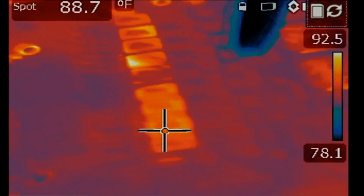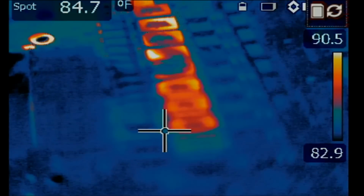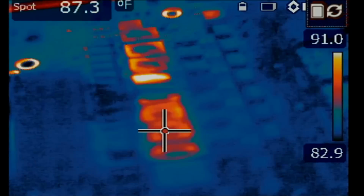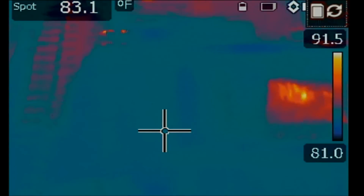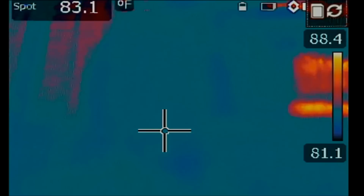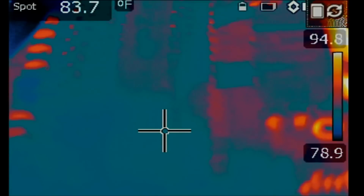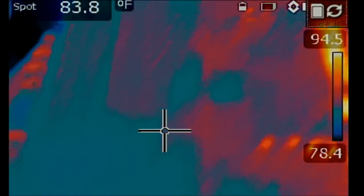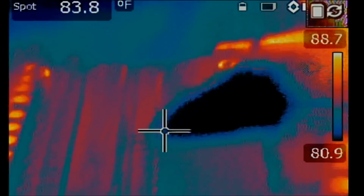So we are interested in this area right here for now. I'm injecting 1.5 volts and we have a 2 amp draw and no signs of heat anywhere on those MOSFETs at all. Nothing. Let's go over here and see if we can see any heat spots even with the thermal pads on. I highly doubt that, but let's see. Nothing stands out as being hot. I'm going to increase voltage a bit and see what happens.